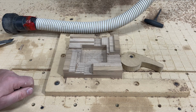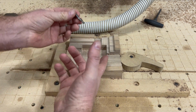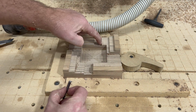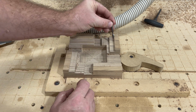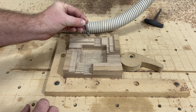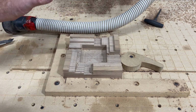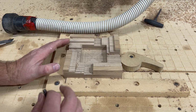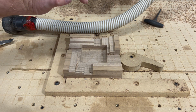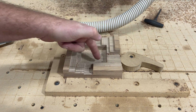Okay, so that was the clearance tool path in preparation for bringing in our ball nose. What it's done basically is removed material at a depth where the ball nose is going to come in and make that angle swoop that we saw in the original piece that I showed you. You may have noticed that when we were coming through here to do our clearance path with the 1/4-inch end mill, we were basically cutting air as it was coming in here and here, etc.